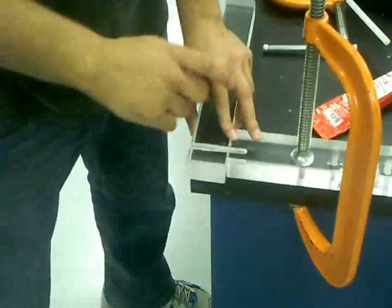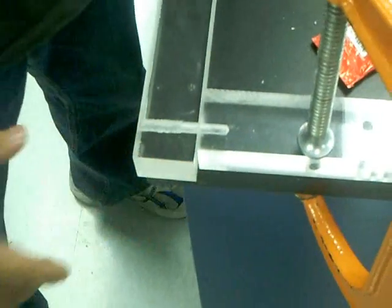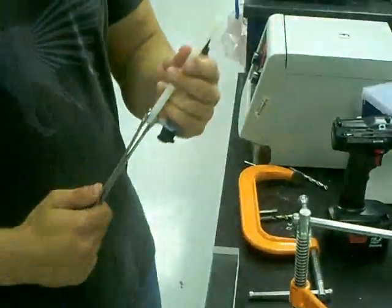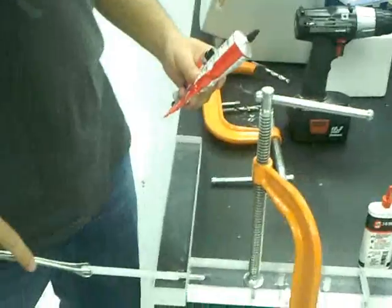Easier if you use some kind of device to do it to help you out rather than make your fingers bleed. So you can see towards the end it's opening up, and then it just comes out through the other end. At this point we've made our drill and tap for the legs and for the side frames, and we're ready to glue the components. So what we're going to do here now is use a combination of epoxy glue to glue the nylon onto the plexiglass, and then we'll use the weld-on cement for the plexiglass onto the plexiglass.